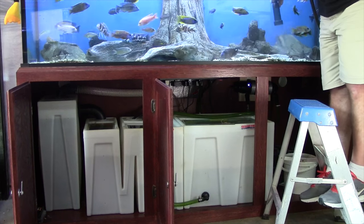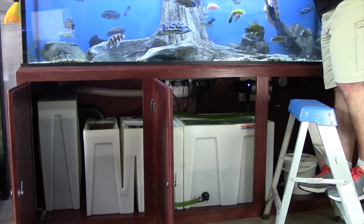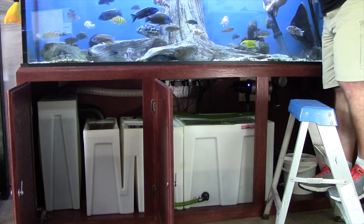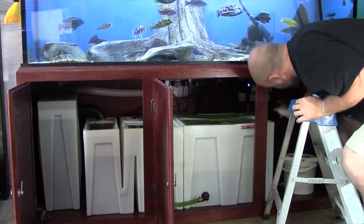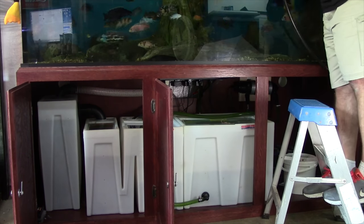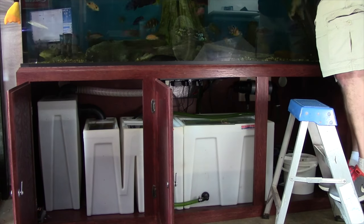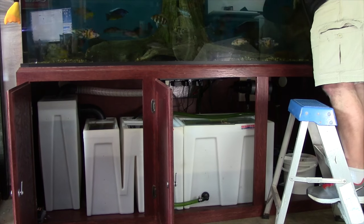I like to let it sit there and drain for a little while, but eventually you'll get to a point where the sump is completely depleted of water because it's not receiving any water to send back to the tank. At that point, you're going to want to immediately unplug the system. I have a switch on mine that I just flick to turn the whole system off, but if you don't, unplug your pumps — if they're running with no water you could easily burn them out.